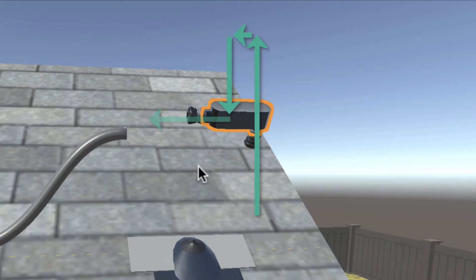Here's an illustration of what we mean. You'd actually pull the wire up from one conduit all the way out of the box — way out, maybe a foot or so — bend it gently, push it back in, stick it out through the other hole, and then allow it to be pulled by somebody else on the other end. You'd have somebody below fishing the wire into the conduit, somebody at this body pulling it out and putting it back in, and somebody at the other end pulling it to where it's finally going.